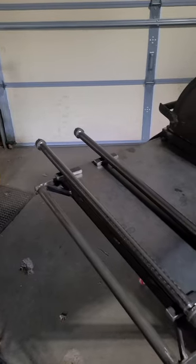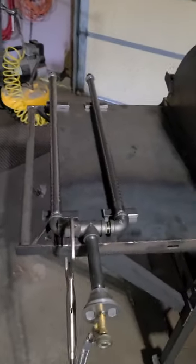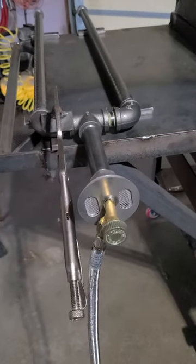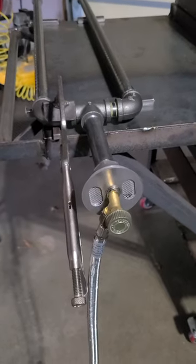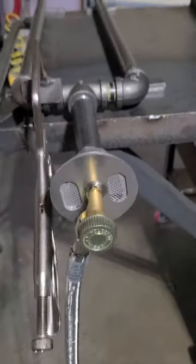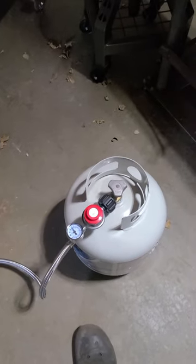This is a three-quarter inch pipe burner for a grill. I built a U-shaped one with two necks coming off of a single input air mixer Venturi. That was about a hundred dollar part from Tejas Smokers — T-E-J-A-S — in Texas. Went on their online site and was able to get that, which hooks up to a standard three-eighths hose, then hooks up to a 20-gallon tank.